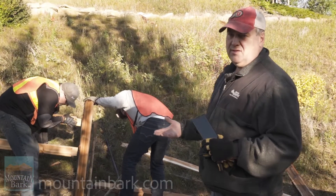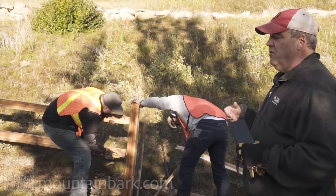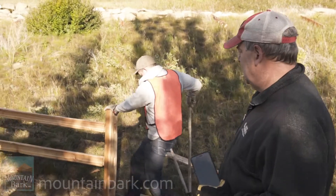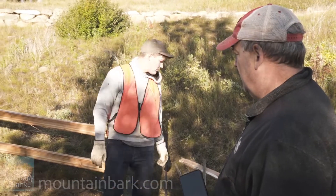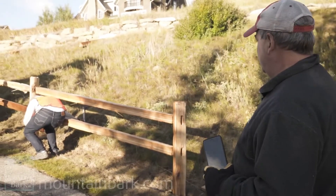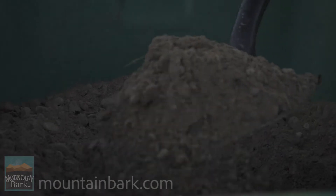The rule of thumb is 27 inches in the ground, but in this case we're going a little bit higher. We're doing a replacement of older fencing and the older fencing was a little bit longer, so we're trying to mimic what they did in the past — matching that top profile while also keeping in mind what's going to happen down the road.